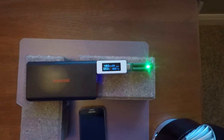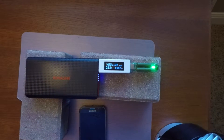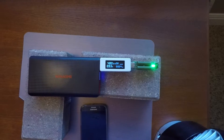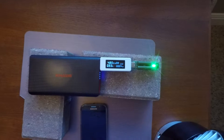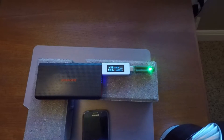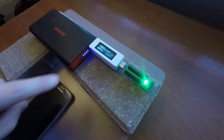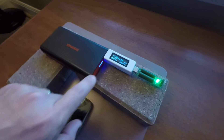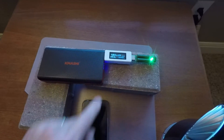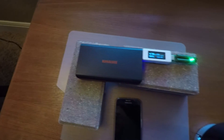As you can see, it is measuring the amps out and the milliamp hours out. The voltage potential is 4.8 volts at pretty much 1 amp. I'm going to step away and let that do its thing until the low voltage cutoff on the brick — the circuitry in the brick — no longer outputs any current. Then I will compare this number to the marked number, which is 15,000 milliamp hours.